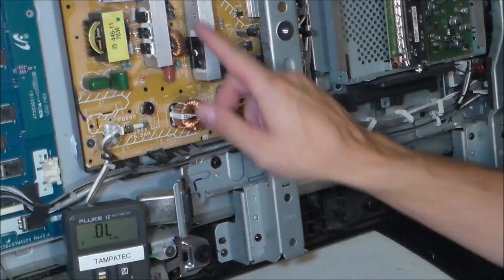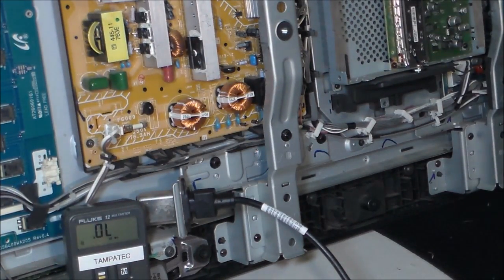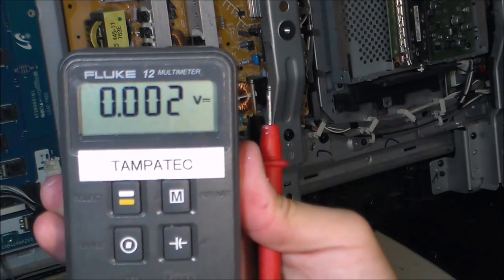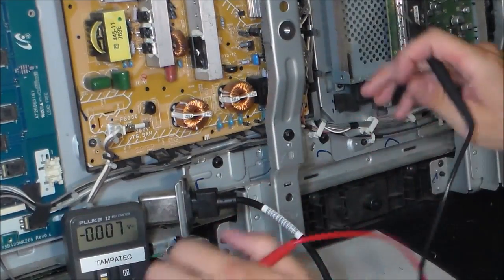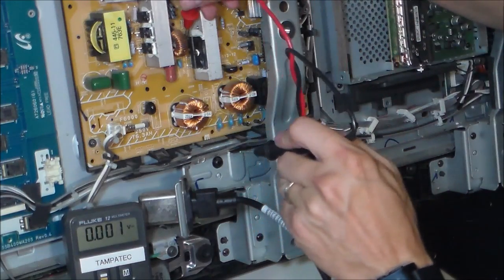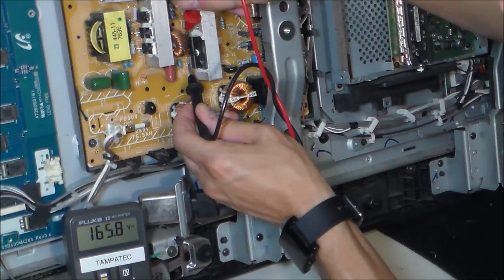Next, I'm going to show you how to read the voltage coming out of here. Act at your own risk when you plug it in - you can get shocked. Plug it in right here. Let's go ahead and change the meter to volts. The straight line is DC volts. I got my red lead on the positive on the board and the negative lead on the stripe, and you read 165 DC volts right there, steady.